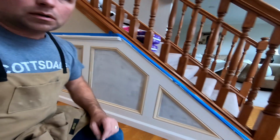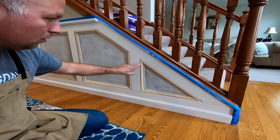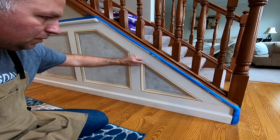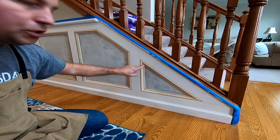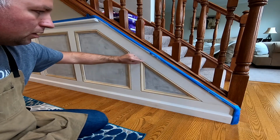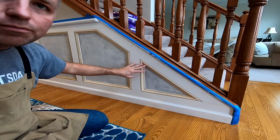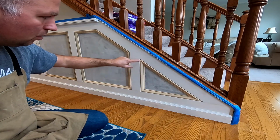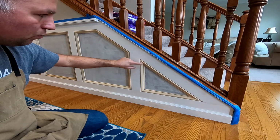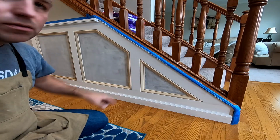One little thing I just wanted to point out was this little section. What I'm going to do is take you downstairs, because this is kind of tricky. These obtuse angles right here have to be cut for these two corners. I'm going to show you a neat trick on how to do these. Now these are obviously the same as these. It's just an inside cut instead of an outside, if you see it. So they're 49 and 41, just like the stairs. But you have to cut these a different way. These are still 24 and a half and 20 and a half. But let me take you downstairs and I'll show you.